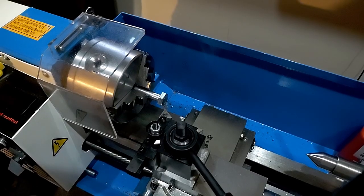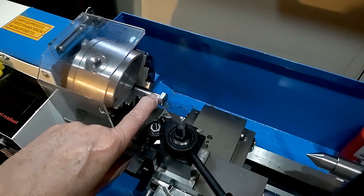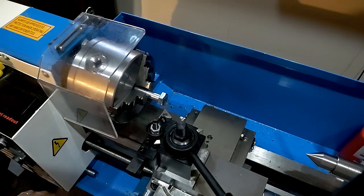So anyway, folks, what we're going to do here is take this here bolt. The body's a 10 millimeter body. It barely goes through the bushing. We're going to turn the head down until it's 11.3 millimeters. In other words, just enough to catch and drag that out.